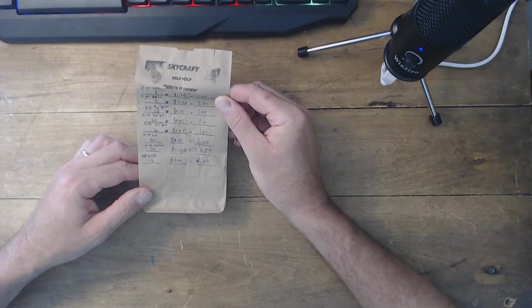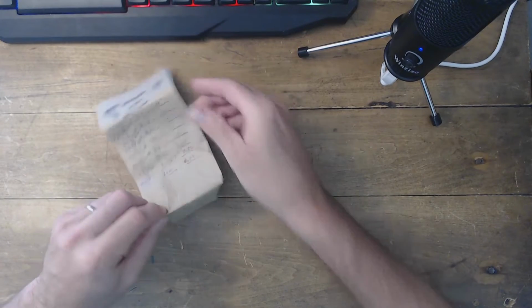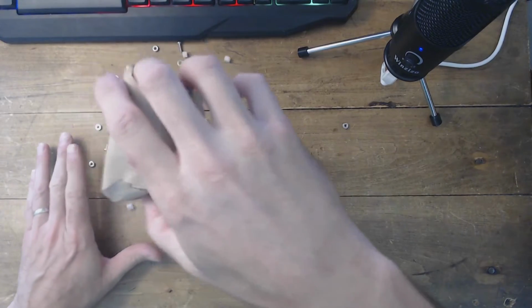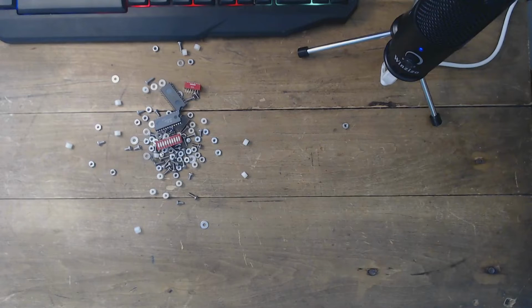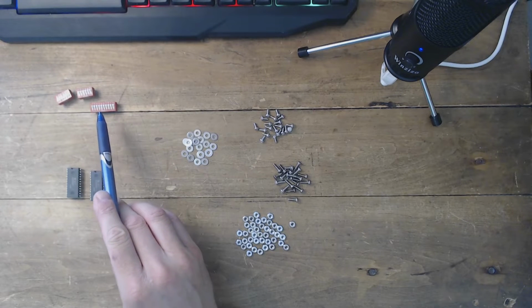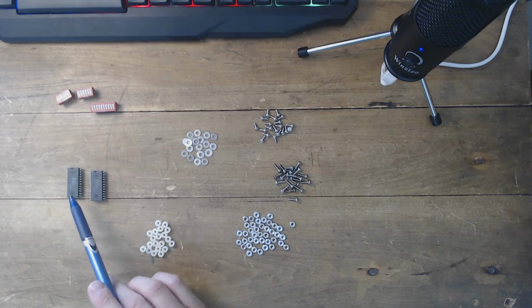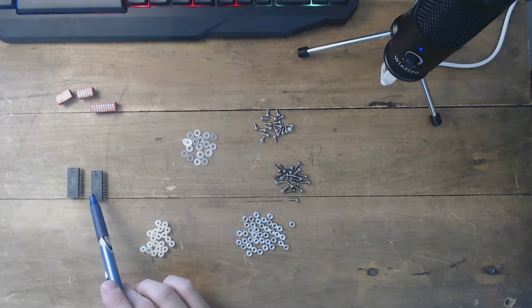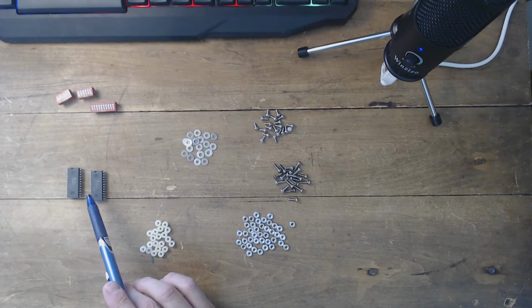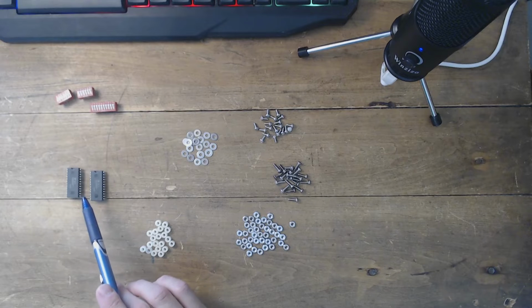Looks like there's some dip switches, 4-40 hardware, and a couple ICs, so here we go. Okay, wow, that's a lot of stuff. Alright, see what this is. So what we have here is a few Grayhill dip switches. I really like these for providing digital inputs to a test circuit. I also did get a couple of the HD6350 UARTs. I'm not actually running my 6809 system at a high clock speed, so I think these will work fine.